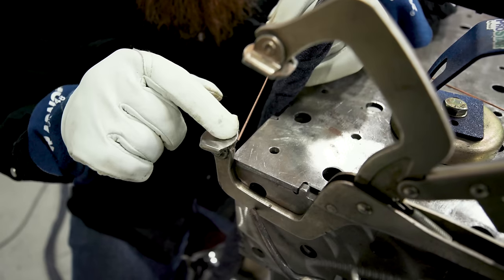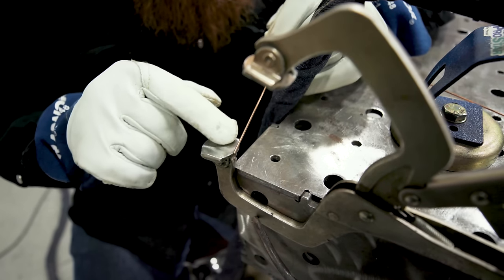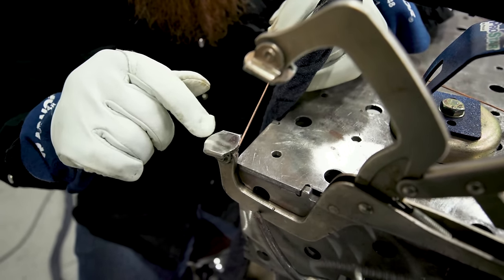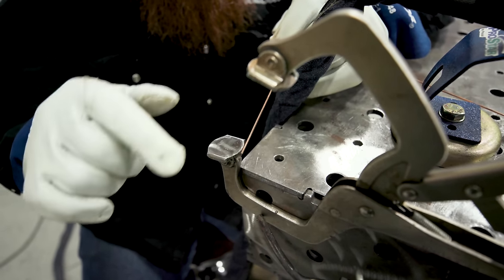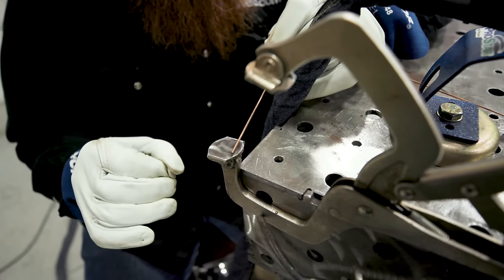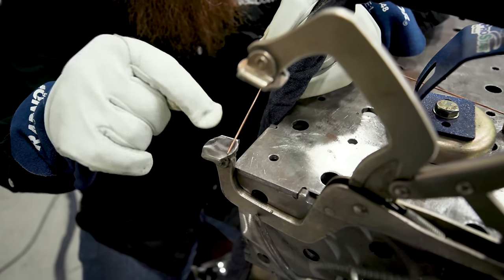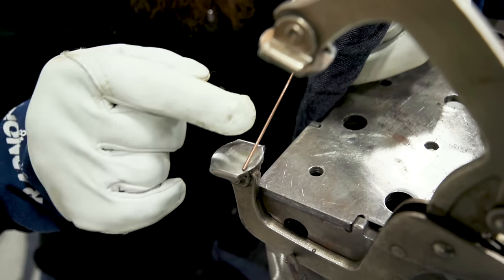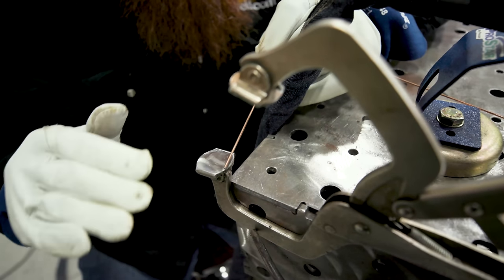What I'm going to do is take some silicon bronze and braze on here with the TIG torch — kind of like a pad — doing some surfacing welds on top of this. I'll stack it up, probably run two maybe three courses across here, then buff that down. I'll do the same thing on the other foot. The silicon bronze is a lot softer than the stainless and aluminum, so it's not going to scratch the material — it'll scratch the pads instead, which I'm not too worried about.